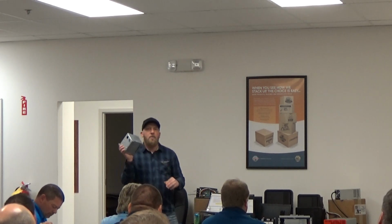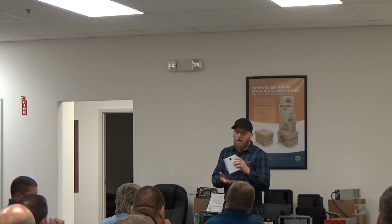Like I said, transfer switch, all it does is give it that time delay. On our T30, that's a 30-amp transfer switch, so that's going to be used with our 8955 PEC. And like I showed you guys downstairs, this can actually piggyback right on the back side of it. That's what a lot of people use. It's kind of convenient, and that way they don't have to gain a whole bunch of extra space or put this in a wall somewhere. We do sell the 8955 with the T30 combo, so you can get this together with your PEC the way it's ordered.